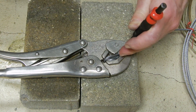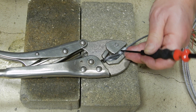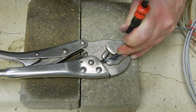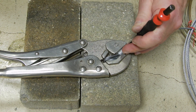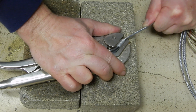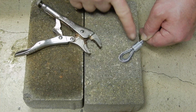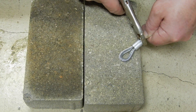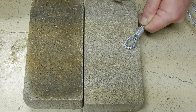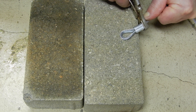Now I'm going to punch it. On the other side I'm going to put three punches, and on this side too — I'm going to alternate. When you have pre-punched as I've done, you take a small vise grip and you block the ferrule just by pushing it, so that you have a nice loop.